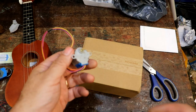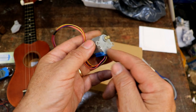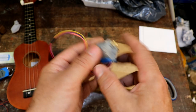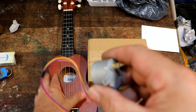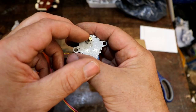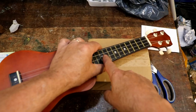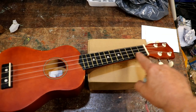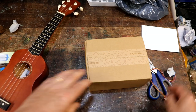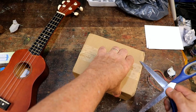In the past I've only ever used these motors, which are fabulous but very geared down — over 2,000 pulses or steps per revolution. They're very slow, and I realised that if I want my melodies to have any sort of tempo, these were not going to do. It's about 4 RPM if that, which means if you were going to move something up and down here it would take ages. You want to do it really quickly.